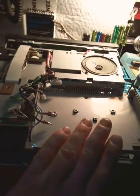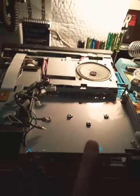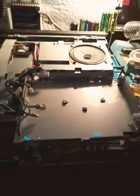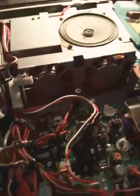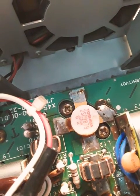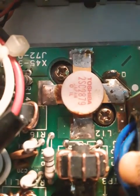My hunch is those voltage regulators — I think it was the five volt one. I was reading the schematic but I have to look up the numbers and cross reference them. This is the PA board. Here are your finals — two SC 2879s, a pair of those. Everything looks good in there, nothing burnt, but I'm concerned about a few areas.